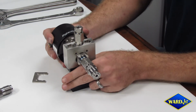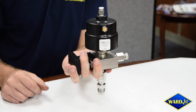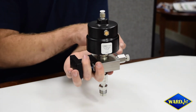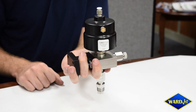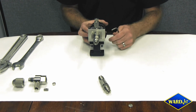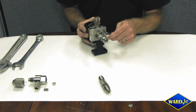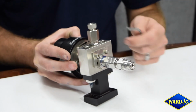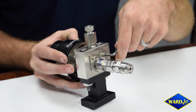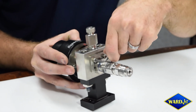So now this would be how your cutting head would hang on the Z carriage. Your high pressure would come in here as a 1/4 inch inlet and be adapted by a 3/8 adapter. To install the bracket on the bottom of the Z carriage plate is a 5/32 Allen key and it's 2 bolts. We simply put blue goop on the bolt, thread it in, and we will just tighten that so it bites.